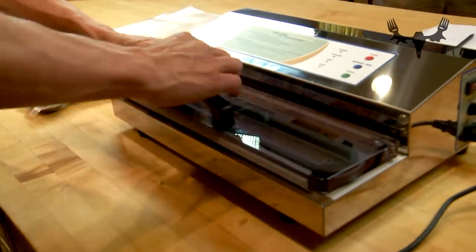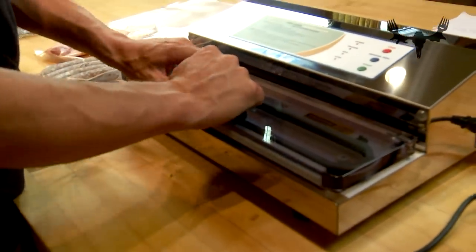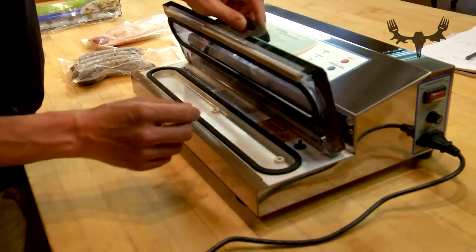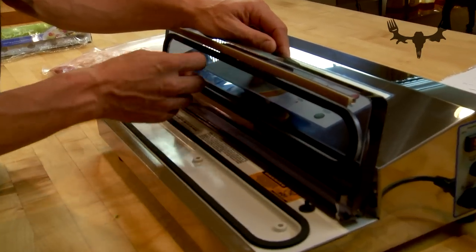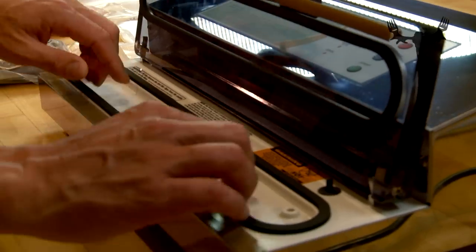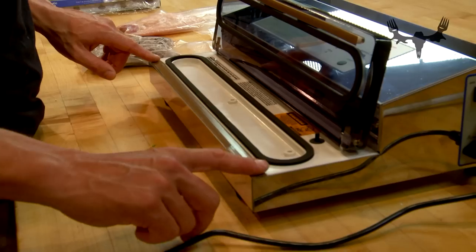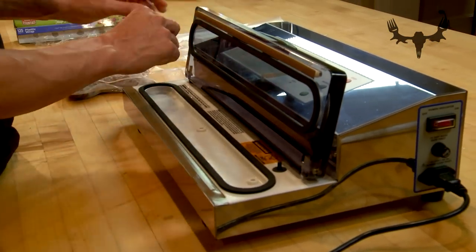One thing I find people do that's really hard on their sealers is pushing down on the door too hard. This thing has rubber gaskets top and bottom — if you compress it too much, you harden and pack in that rubber gasket and you won't get a tight seal anymore. Another thing is letting too much water from fish or other product get up into the sealer, onto the sealing tape, onto the gaskets, and into cracks and crevices, which can lead to destruction of your sealer. Keeping the thing in good shape comes down to treating it with respect and adhering carefully to the manufacturer's specifications.